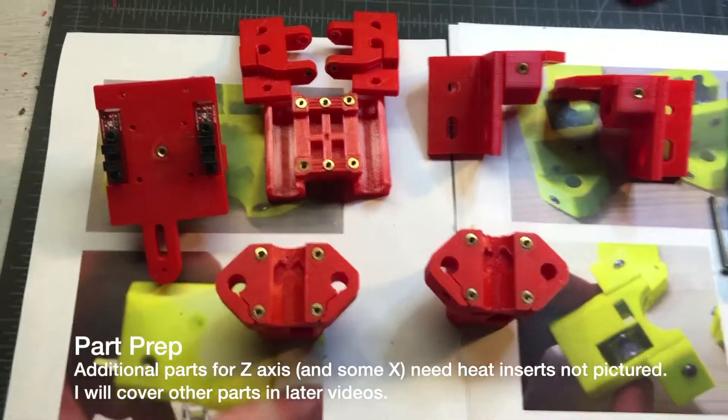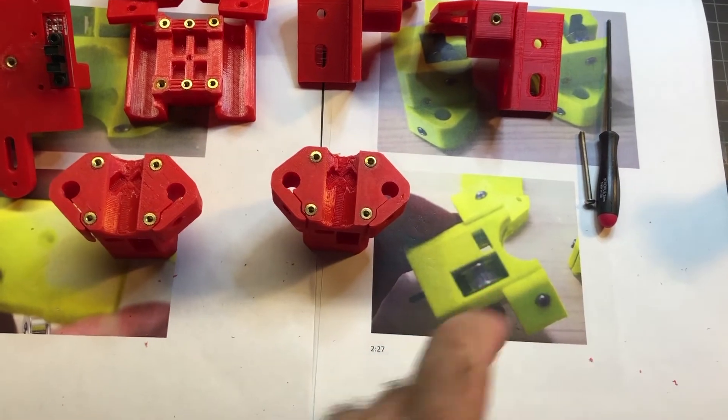It's possible that I may have missed a few. I ended up taking screenshots that you can see behind me during the video. The knurled inserts were pretty challenging — probably the toughest part of the build because they're really easy to mess up and there's a lot of plastic involved. I did end up putting a couple in the wrong spot because I was eager and not paying attention. Just take your time, make sure you've got all the right spots, use all the resources you can, watch videos. I think the Dow High videos are one of my favorites for seeing where the inserts need to go, and I'll put those in the description.